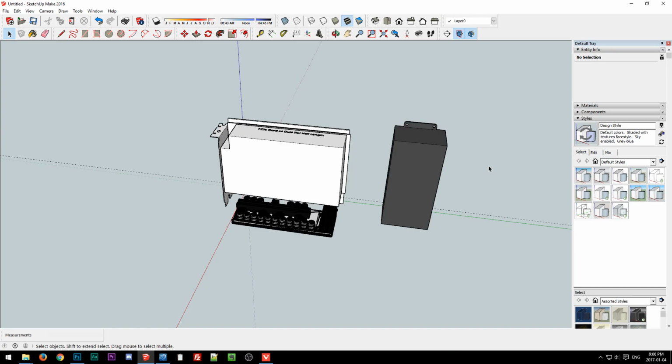The thing is, part of the ATX spec is that ATX power supplies can handle that type of thing, so this never really became a problem. If you have it hooked up to a normal ATX or SFX power supply, it's fine. The problem is if you try running a Nano off an AC adapter, like a big laptop brick, because they're designed to power laptops, and laptops have batteries that can absorb that type of spike. Besides, the laptop hardware doesn't really spike like that anyway. So the issue with the Nano is that it would spike, and the laptop brick couldn't take it, and the unit would shut down or just be unstable.